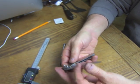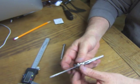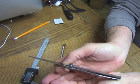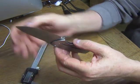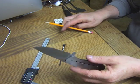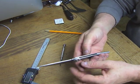And one of the most important things is that I still have room to time the lock to the blade. And so you can see I've just got a little bit of the blade there. The bottom of the blade, I'm going to grind it at an angle, and then the spring will spring over to be able to lock it. And it'll just be right in there. Take that off at an angle, and we will have a knife that's able to lock.